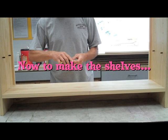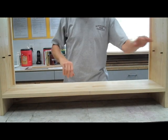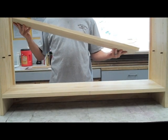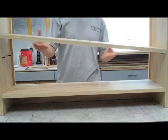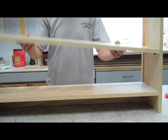The shelf width is three feet. I pulled it all three feet. I put pegs in just at the bottom — these are three-foot pieces, so they'll fit in perfect. But it's kind of hard to put those in, so I'm going to take about an eighth of an inch off of this. I went ahead and cut it on the table saw — tried it for fit and it's perfect. I now have all three shelf pieces.